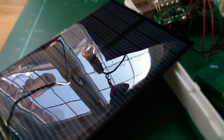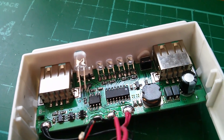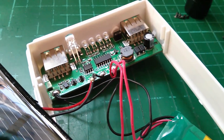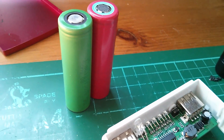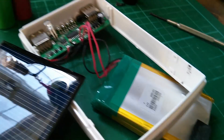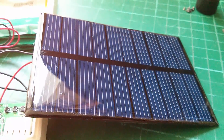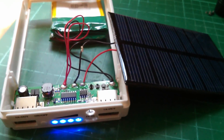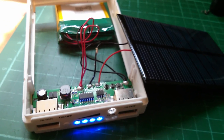If you ignore the solar panel and just connect 5V to the micro USB input to charge the two 2400 mAh cells, you've got yourself a moderately good mobile power bank — though the capacity is no more than two 18650 cells. Two standard 2600 mAh 18650s actually have more capacity than the two flat packs in this power bank. Because the solar panel side is so poorly implemented — with those four LEDs wasting most of the incoming energy except under direct sun — I can't really recommend this mobile power bank.